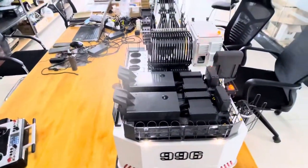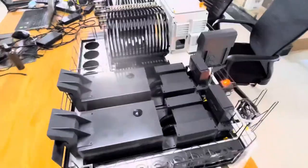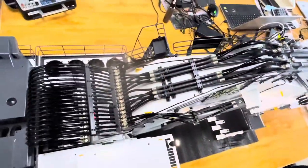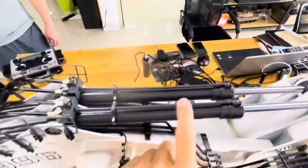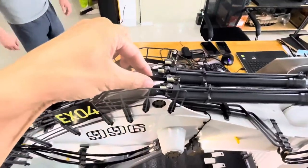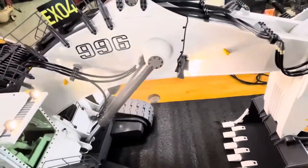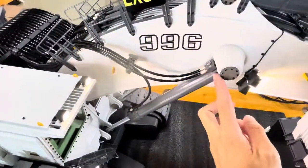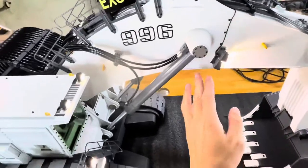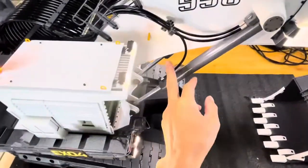Now we will stop it and explain a few details. You see all the wires and hoses here. Each cylinder — you see we got one inlet from the top and two inlets from the bottom. When pushing out it needs more power. For lifting the big arm up, we got two inlet hoses because the arm is very heavy. When lowering it down, only one inlet hose.